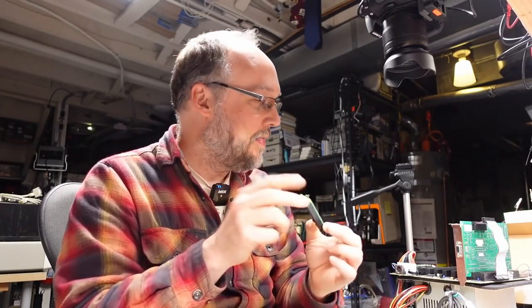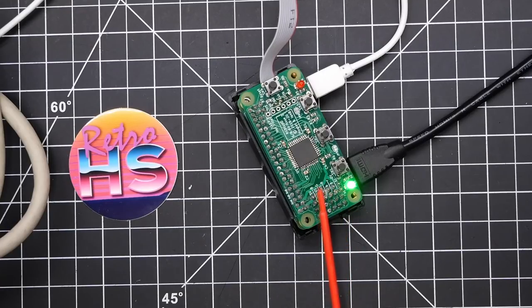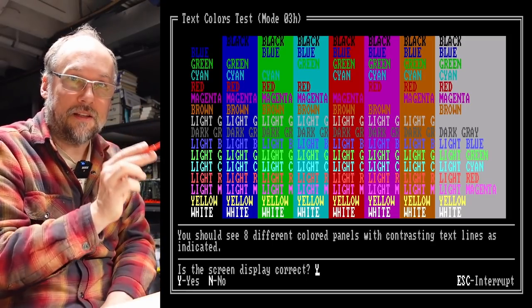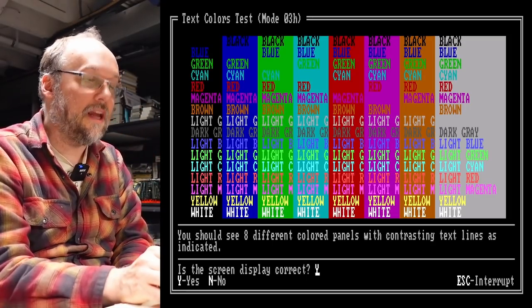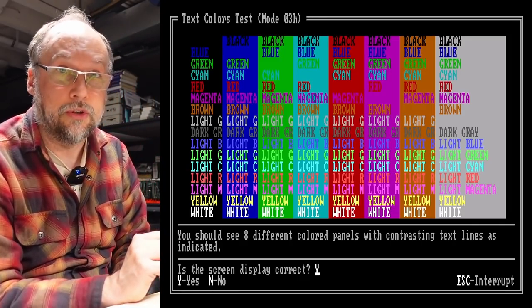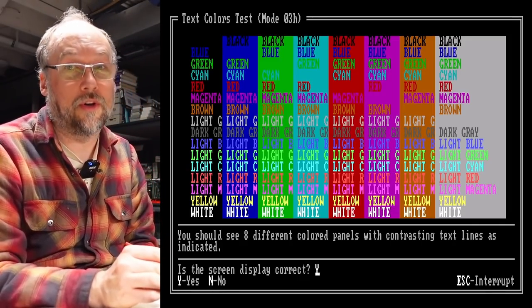Before we do that, let's test this to see if it's still not working, and that way when it's repaired I'll know because we'll get a working image. The bench PC is set up with a CGA slash monochrome VTEC card, the bad CPLD board reinstalled on the Raspberry Pi, and OBS configured to capture the HDMI output. It's set for CGA and you can see it looks absolutely perfect — all 16 colors are represented, all those bits are working.